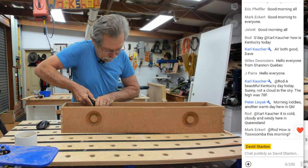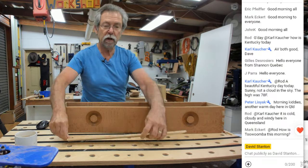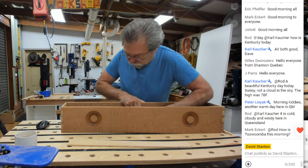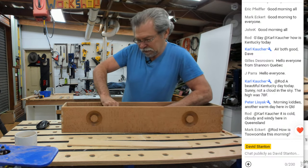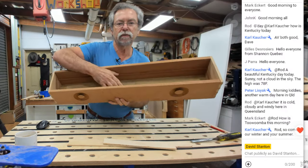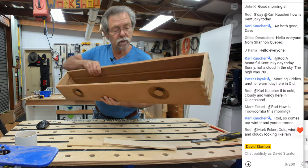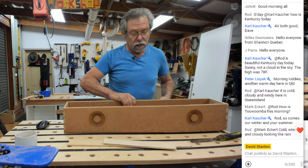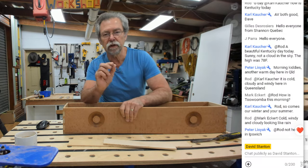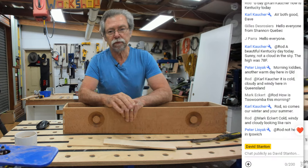So at the moment, I'm going in there and popping this out. These were a couple of ply packers that I put in. I ripped them to the right size, the right height. I don't know if I'm going to do anything else underneath to stop things catching in there, but I've got a nice area here now. A couple of drawer slides, out of silky oak again. I ripped all of these on my small bandsaw. I'm not keen on putting really small stuff over my table saw. People do it. I'm not one of those people.